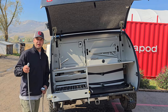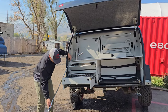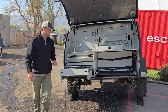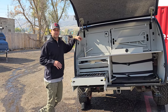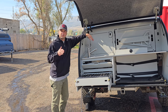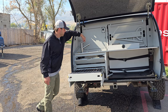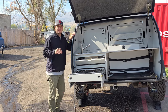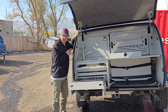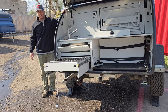With the pump running we're going to go ahead and plug our shower into the shower mixer. With the shower now plugged in I'm just going to dangle it off the back of the trailer here and make sure that the shower head is in the on position. With our pump running we've allowed pressure to build for approximately 30 seconds. After that pressure is built we're going to open the faucet in the neutral position in between hot and cold. This is going to allow the water that's in the system to sputter out. We're going to open it for about five seconds and then close the faucet. After that we are then going to open the shower mixer.